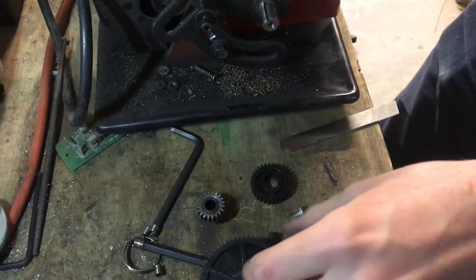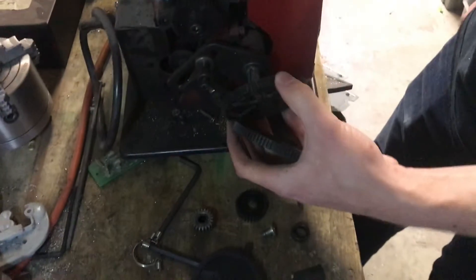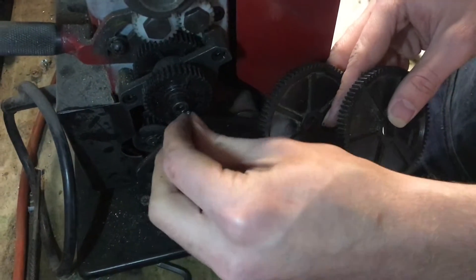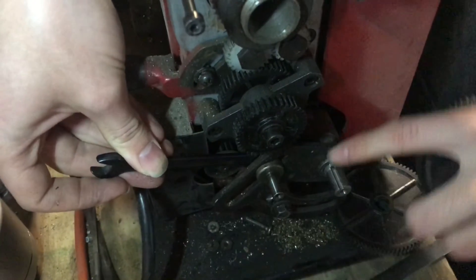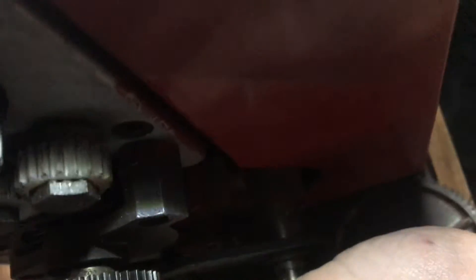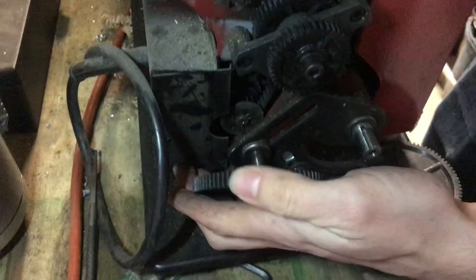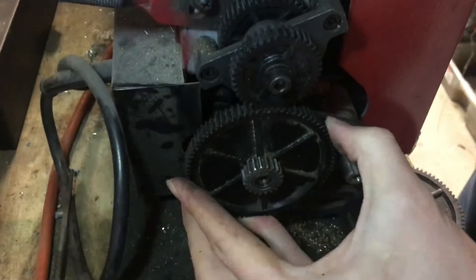It's not actually a gear. Now we can rearrange with some of these larger gears. In order to go slow, we'll want to go from a small gear to a large gear. In order to get this to fit and mesh with the gears, there's a nut behind here that you can loosen which will allow this to slide into meshing.